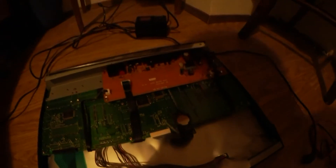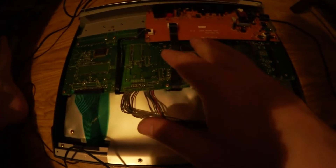The unit is open now and we can see different things inside. Here we have the main board with all the ICs and processors, the backup battery — you have to change this battery every 10 years or so. And there is the part we are interested in: that's the power supply section. We have a voltage regulator, some transistors, some diodes, one IC, and a few caps.